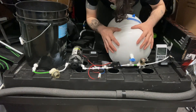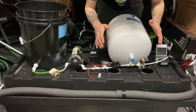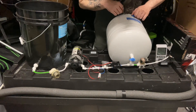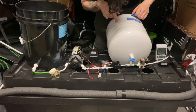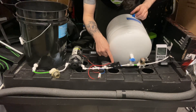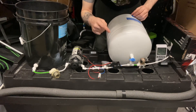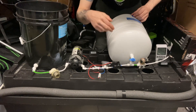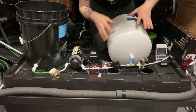Once the accumulator is filled, it shuts off the switch and cuts power. Make sure you inflate the air bladder in the back — there's a valve like a tire pump. You want to pressurize the bladder about 3 PSI under your switch setting. So if your pressure switch runs at 80 to 100 PSI, set the bladder to about 77 PSI. Storing that passive energy in the accumulator tank is one of the most important parts of an HPA system.